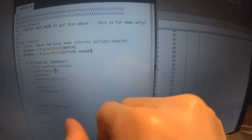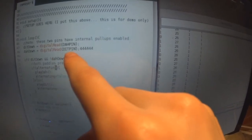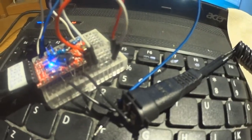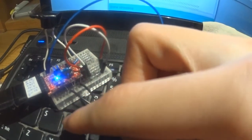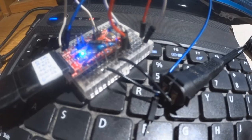We have a tendency to hit the dots way before the last element is sent, so I want to account for that. One way to do it is to use hardware interrupts on special pins — whenever a rising or falling edge is received, the processor stops, does something else quickly, and then returns. However, we're not going to do that because we're going to move straight into the capacitive touch approach.